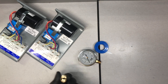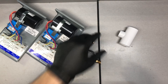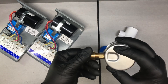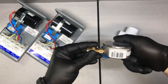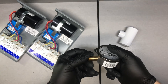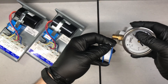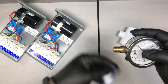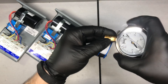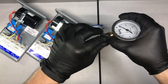I don't happen to have any of that today, so what I'm going to use is what you typically find in the aisles — Teflon tape. The biggest thing about Teflon tape is when you're putting it on, think about the orientation that it has to turn to go on. You want the Teflon tape wrapped in the opposite direction so that it doesn't unravel the tape as you thread it in. You want to roll this on basically counterclockwise, so when you tighten it in it's on the backspin.